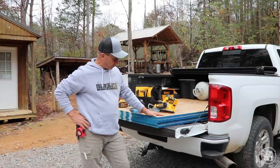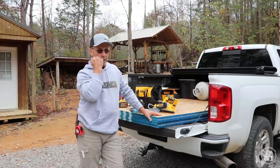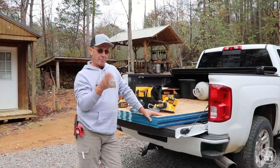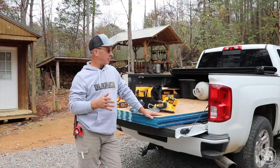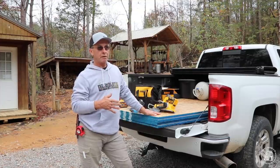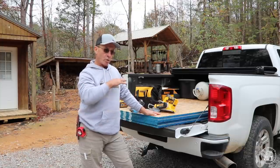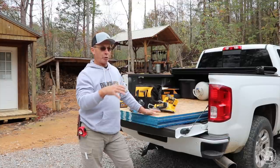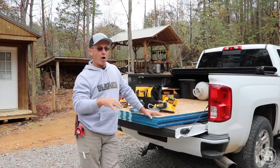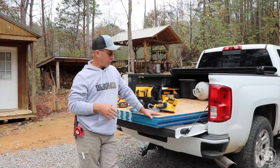What I have in mind today, you can see I picked up 8 pieces of this OSB. It's half inch. I'm going to put it around the bottom. My idea is that I will put it on the small knee wall that I built, and then on the outside of this, I've got a big roll of tar paper, roofing paper. I will attach that on the outside because I don't have gutters yet, so sometimes the rain, when it hits the ground, may splash back a little bit, and once I get the plastic laid out, I don't want the water pooling up in some of the shallow areas, because I'd have to go down there and dry it off. So I'm thinking that if I go ahead and put this on, close that bottom up, the tar paper will keep this from getting wet.